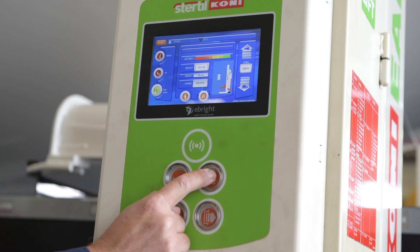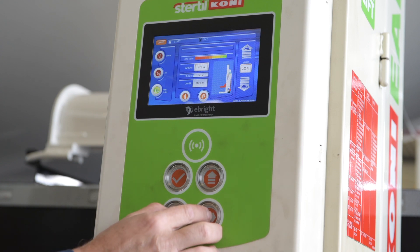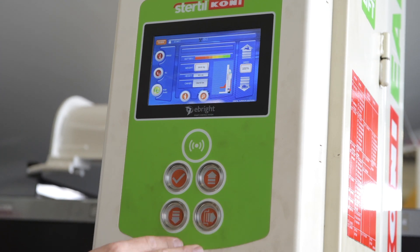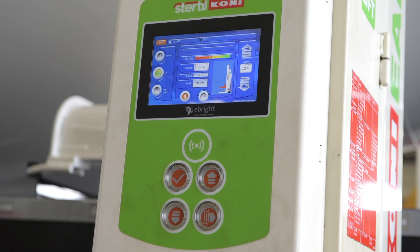With any operation, when the columns of the group are not all selected, an acoustic alarm will sound when the columns are either raising or lowering. When the group columns are in single or paired mode, an acoustic warning signal will sound. For more information, see the manual. Make sure you always go back to all mode after paired operation by pressing the all icon on the screen display.